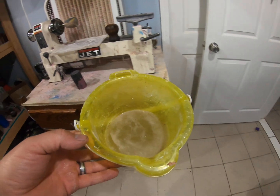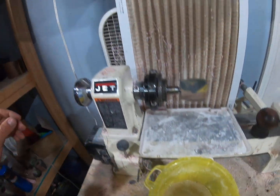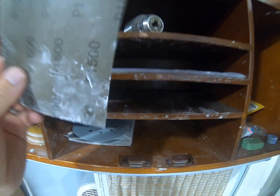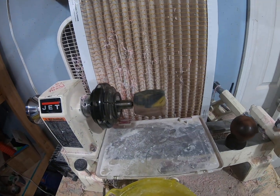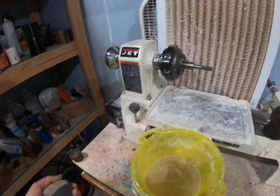The bucket of water, dirty in this case, comes out, and then I work my way down again from wet sanding. I wet sand again with the 320. I wet sand with the 600, and I wet sand with the either 1200 or 1500, running out of that stuff until I've got a nice matte type of finish to the knob, which again, this is not at that point.